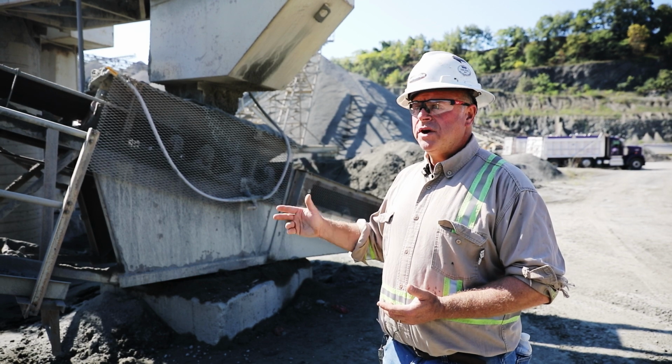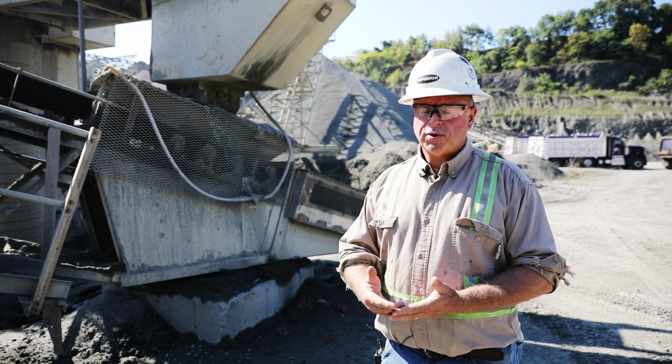If you have material going into the tail pulley, one of the best products out there again is our Chevron Wing. The Chevron Wing is a self-cleaning pulley. The material comes in and the chevrons discharge it off to the side. But again, you have to have the clearance at your tail pulley to do that.